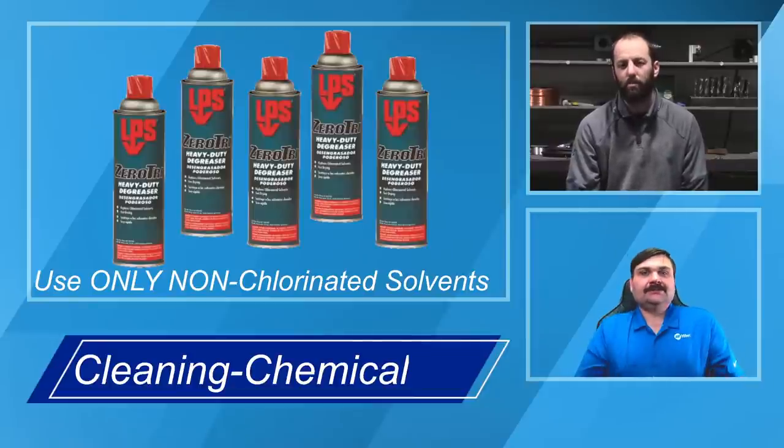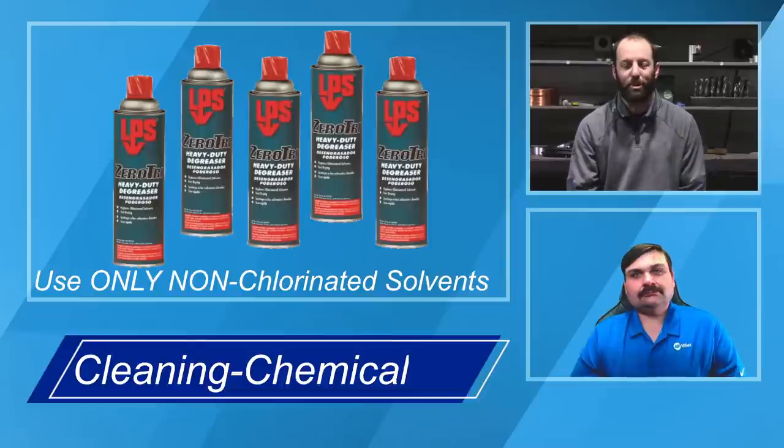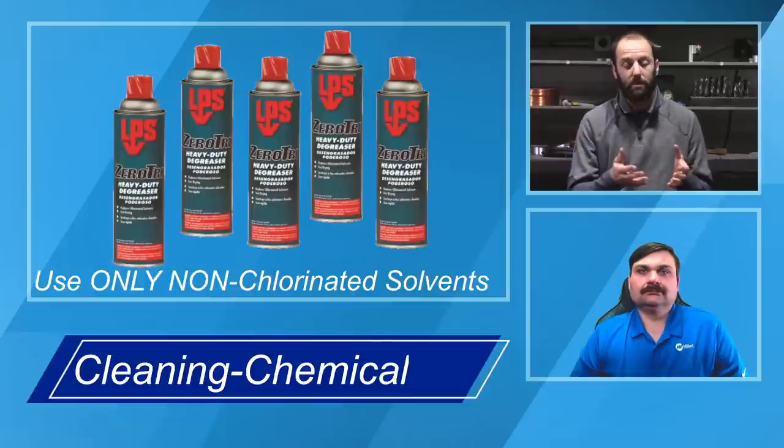One issue with using an alcohol-based cleaner is that alcohol is going to attract moisture. It can pull moisture out of the atmosphere and deposit that onto the material. So generally, we would not, but you can. It all depends on how dirty your part is and what you have available. It could be better than not using an alcohol if you have extreme amounts of grease. But in best practice, if we're looking at an aerospace application, that's not going to be the preferred method. We're going to have relatively clean base material, and you're trying to get the cards stacked in your favor in that deck. There are better options out there if they're available.